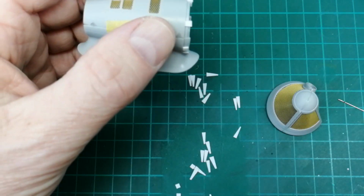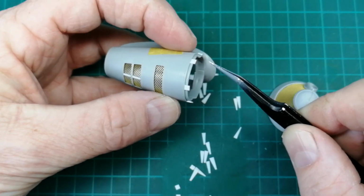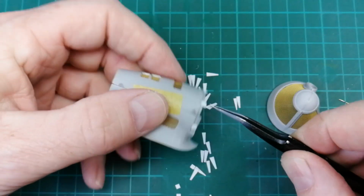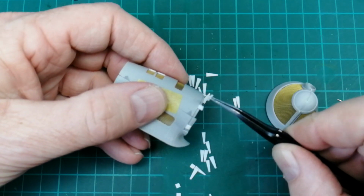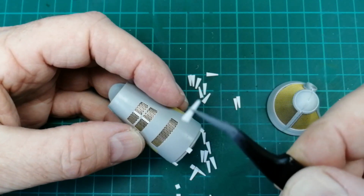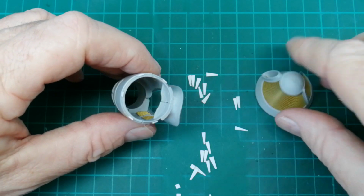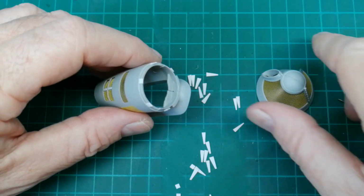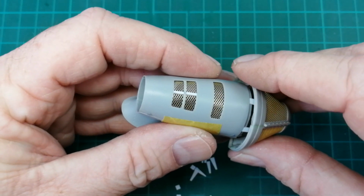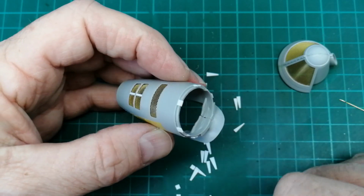So my idea, and I'm making this up as I go along, I've cut some plastic strips, 5 altogether, and then I've cut some plastic wedge shapes, and then I will glue one either side of those bracket pieces all the way around, so there'll be 10 of these to glue on. I've made them bigger than they should be, and then somehow, once all that's done and set, is to trim it down to size, and hopefully these U-shaped brackets will give it some strength.